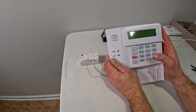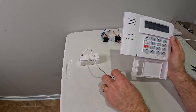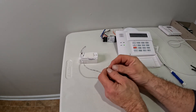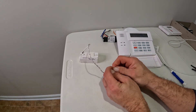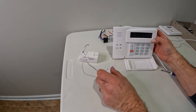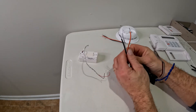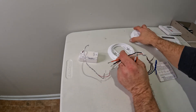I'm going to exit out of programming — it's just going to show an open circuit. Once it registers, wireless sensors on Honeywell take up to four minutes to actually report back to the panel. If you just touch the wires together and undo it, it'll come up and show you that it's opening and closing. You can either wait for it to report back or touch the wire together to send a signal. Now I know my zone is opening and closing. If you've found the end of your line with all your smoke detectors, we've taken down the old smoke detector.